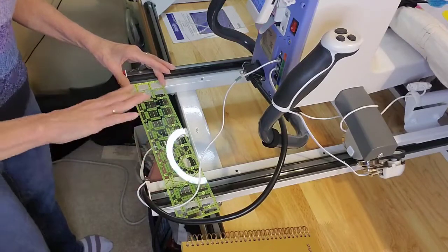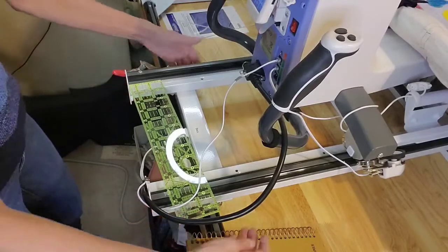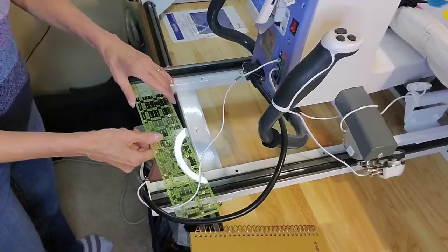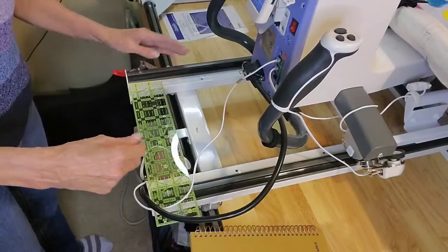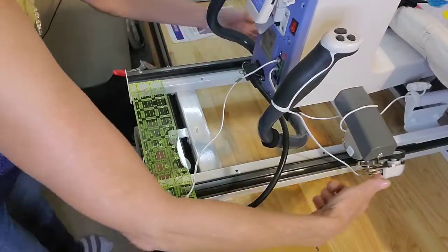If you're out of square, take your machine off and turn the carriage over. There are some nuts on the bottom of this brace — loosen those, twist it until you can pull it and it's square, then tighten all of the bolts. You'd want to loosen all four.